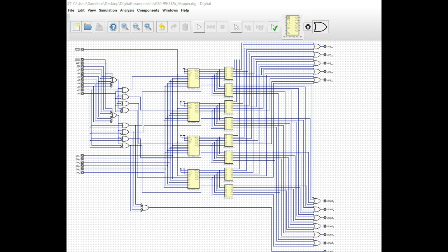So now we've reached that point of exponential growth. Now we've expanded upon the circuit to include the ability to read and write the data to the bus. Now, in reality, if you were doing this from discrete logic, a lot of this you wouldn't need, because it's going to have output enables and simply tying into, for example, a driver chip transceiver such as a 74HC245 or something along those lines. You would be able to read the data from that port and not have to worry about a lot of this logic. But we are focusing on designing things digitally for use in CPLDs, so we've got to include some additional logic here.